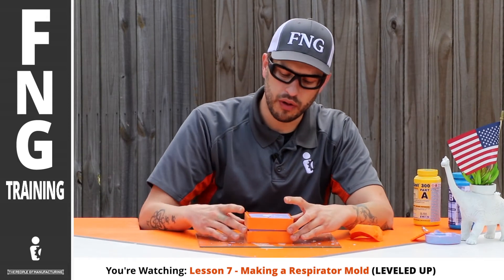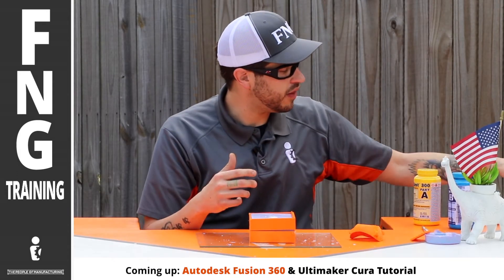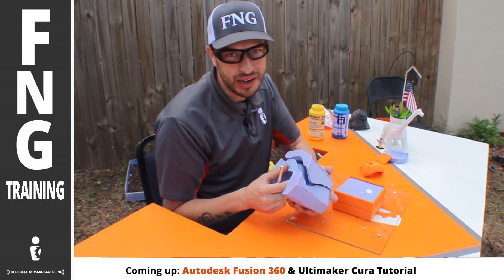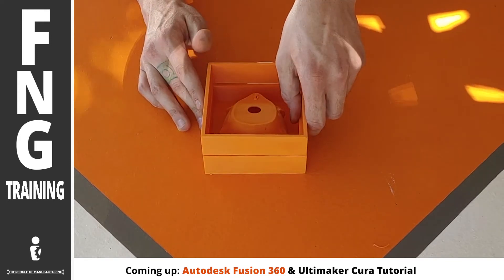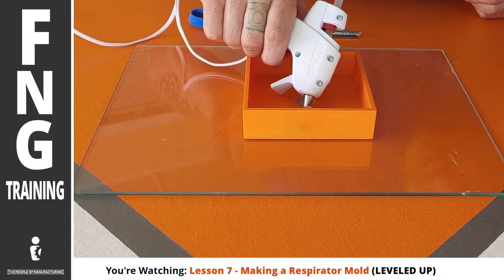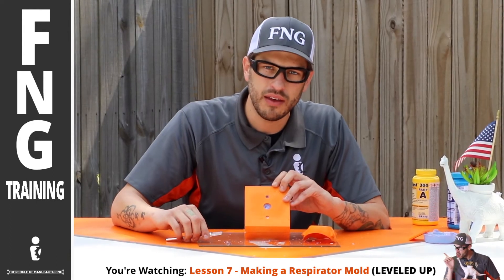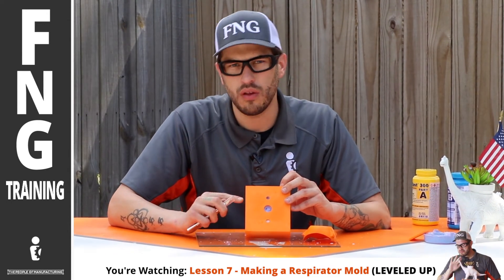Because this was a two-part system, I knew where to cut every single time. If you watched our second video on making this mask, when I had to cut this guy out — imagine the same X-Acto knife having to dig to find your material, destroying your mold along the way. Silicone is amazing, it can heal itself, but it's not Wolverine. After we set up our box and had it 3D printed, we snapped it together. We used our three-hole system, filled them up with hot glue, and sealed off the holes I'm not using. The smoother it is, the easier your silicone is just going to pop right out.